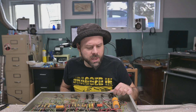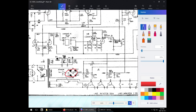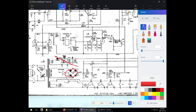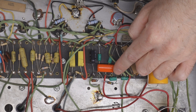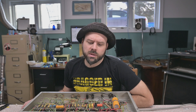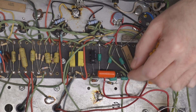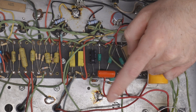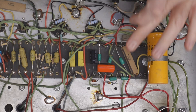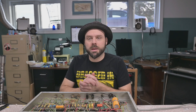The power supply circuit is mostly similar. We have a bridge rectifier here. But we do not have a separate power supply circuit for the bias — instead, we have it tapped off the full wave via a capacitive dropper. That's actually not a bad way of doing things; I've never really seen it before in any other amps. There's a Sprague Orange Drop 0.047uF here that does not look period correct. The main bias cap has been replaced, and there's only one of them — most every amp has two bias capacitors, but I guess maybe we don't need it with a capacitive dropper circuit.